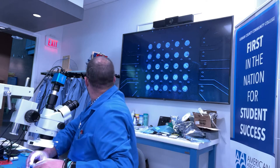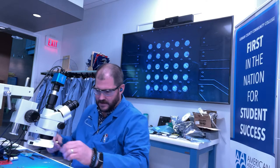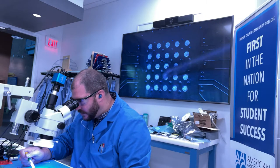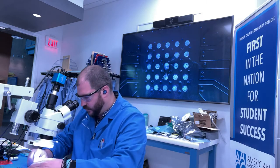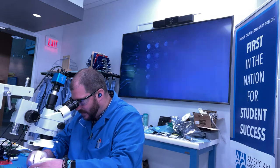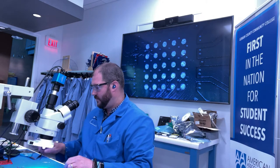So now my interposer is looking pretty good at this point — the underside of the chip, the bottom part that's going to be put down. One of the next tricks is to take some fluxing agent. Normally flux is your friend and you want to use a lot of it — not in this process. Don't use a lot of it. You need very little fluxing; use too much and you're going to be in an awful lot of trouble. Normally I use something like a hotel card — I'm just going to spread this around with my finger here.